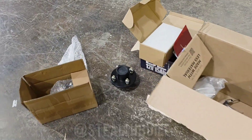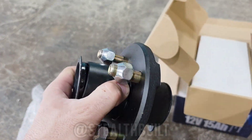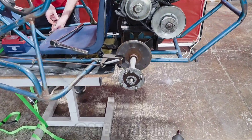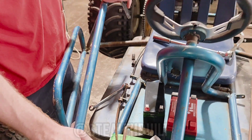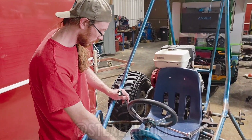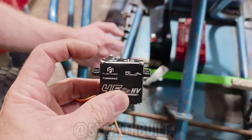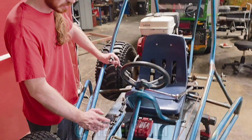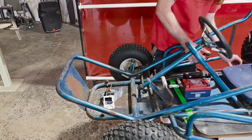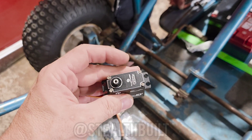We've got our trailer hub right here, which is supposedly a one-inch ID shaft, and hopefully we can bolt that on and have a free-spinning hub. Basically we're going to wipe out all the pedal assembly in here and mount up some tabs for the servos to sit on — they're just going to pull on the existing linkages. We'll use an arm and it'll just pull on that cable, making it like a big nitro RC car essentially. These are 45 kg servos, so they've got quite a bit of power, but we don't want to overload them.